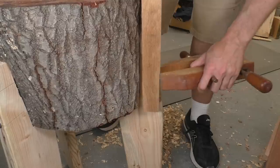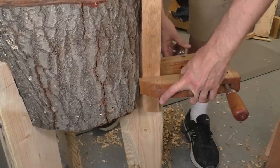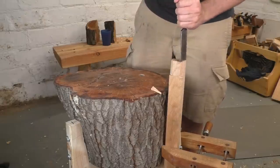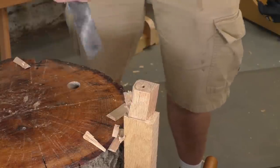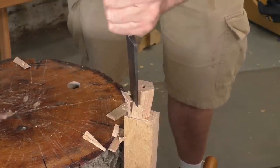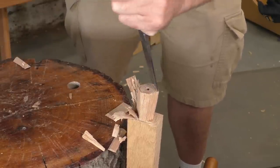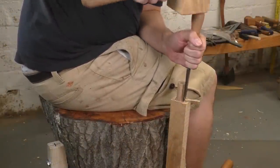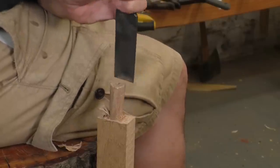If we're going to make furniture, we also need some way to work on the ends of pieces. Like if I wanted to make a simple chair and had to carve a tenon in the end of a piece of wood, I'd have to hold it upright and have good access to the end. I think I can do that with this bench — all I need to add is a simple screw clamp. These wide 2x6 legs give me a broad clamping surface and the screw clamp lets me hold even narrow parts straight up and down. I can clamp a long piece like a chair leg at any convenient height, then it's easy to carve a tenon on the end. Even though I'm hitting straight down, the screw clamp provides a lot of grip and the piece hardly moves. If I want to get closer for details or final paring, I just sit right on the block — it's more than strong enough to support my weight.